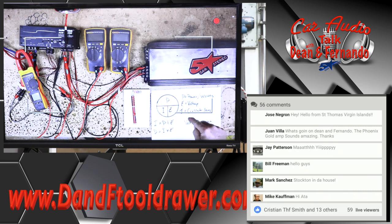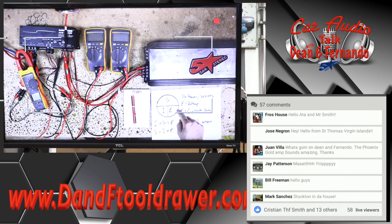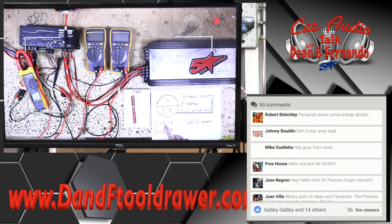This is where it gets confusing: P is power — that makes sense. E is volts — that doesn't make sense. And I is current — that doesn't make sense either. But what we want to figure out is the most basic one, which is current equals power divided by voltage. This is the normal one we'd figure out.